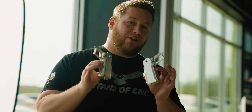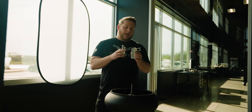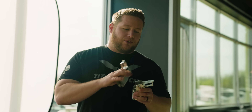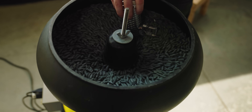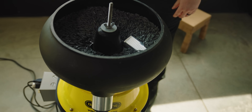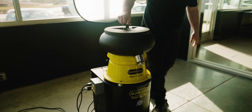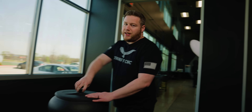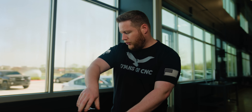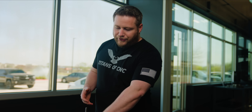I just got these from the EDM and technically they're finished, but I'm going to go ahead and tumble them in ceramic to get rid of the feed lines and get rid of some of the burrs left behind from all the sharp corners. After a couple hours in the tumbler, that's going to be plenty good to get rid of the burrs and feed lines. These parts are going to get anodized, so there's no real need to do anything else after we've got the burrs off.